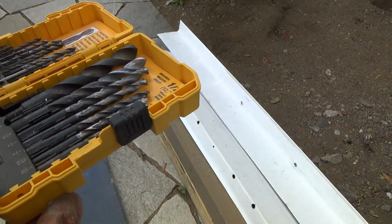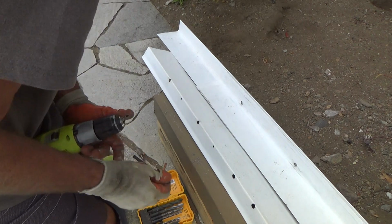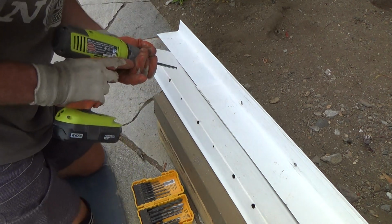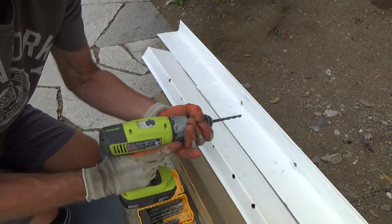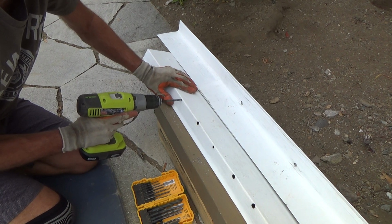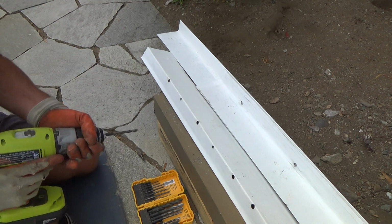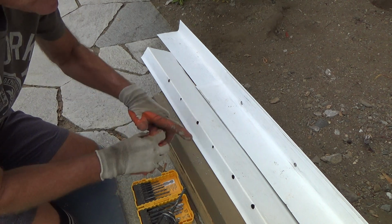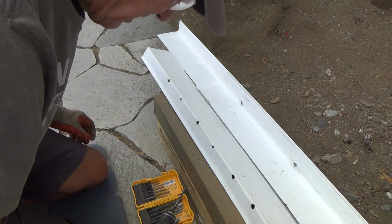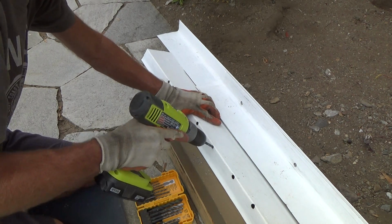Boom. Okay, so now I'm going to go 1/4 inch. I'll go 1/4 inch. And I think after that, my reamer bit will fit. It's tight. Just hold on to your chuck. Now see, let's see if this tip fits in. It's just barely too small. Now I could go up to 5/16, or I could just use this and I can ream it out a little bit.